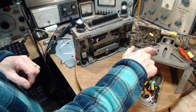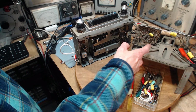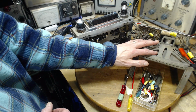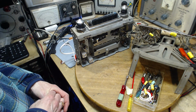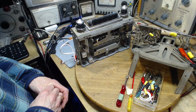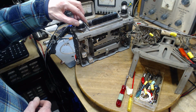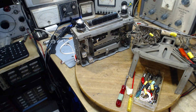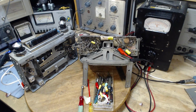I don't remember this buzzing away. But I may not recognize the buzzy sound from the speaker versus the buzzy sound from the vibrator. That makes it pretty apparent. Again, with the automobile operating, you'd never hear that, I'm pretty sure. Of course, if you park somewhere, you're going to be listening to that thing running. Okay, let's just let it all warm up for a few minutes, and we'll go at it. This will be the first car radio I've tried to align.